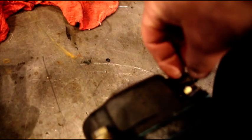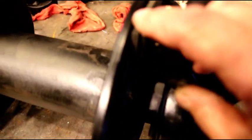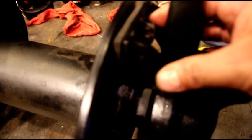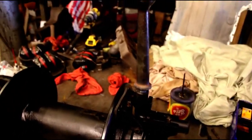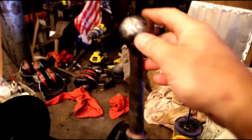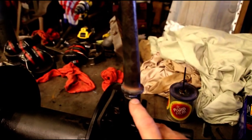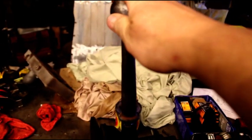And there the band is, I got my adjusters on the springs and everything ready to go. On this side, I put a new brake shoe on here. I just got to put a spring, a bolt and a spring set up here, which I'll do, and put a handle on it. This is 1/2-inch NPT, so I got an adapter in there, and then I always save handles like this from various equipment, machines, stuff like that. I think that makes a real nice handle for that.